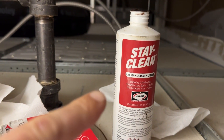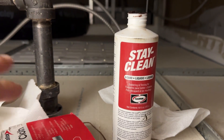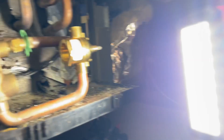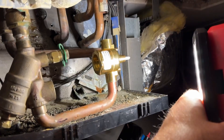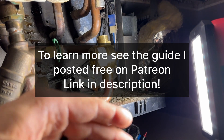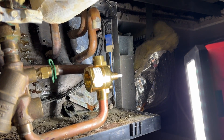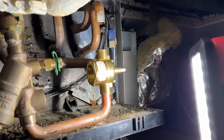I'm using this acid flux here. The disadvantage is it's very acidic, so you need to clean the outer surfaces and all that. But it has a higher activation temperature, so it can take more heat when you're soldering in a tight place or doing stainless steel or anything like that. It's a great flux — very forgiving, very aggressive, very good at cleaning things even if you don't get them perfectly clean.